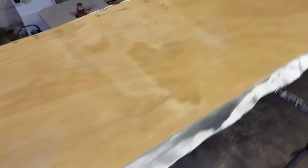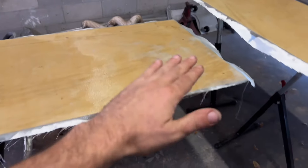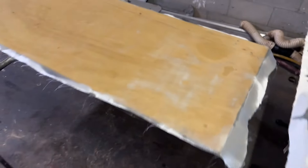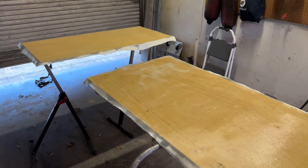You guys can see there are these weird white patchy areas here — I promise those are not voids. Those are areas where I had to sand because we had a bunch of footsteps and boot marks on the boards from us test fitting them and standing on top of them. I didn't want that contaminating the resin or the glass itself. So I went ahead and sanded that stuff down with some 120-grit — it was probably a little abrasive, as you guys can see. I promise they're not voids. I've checked them, I've rolled over them multiple times with the little roller, and I've even pressed them down with my finger just to make sure there are no air pockets.